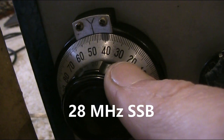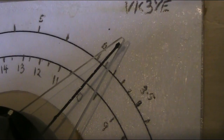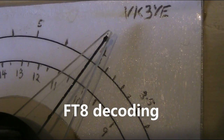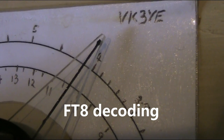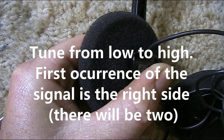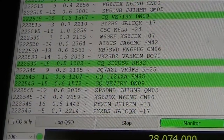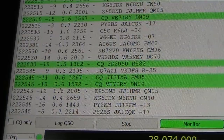As I'm using a 24 MHz crystal in the converter, 4 MHz coincides with 28 MHz. Just above 28 MHz, at 28074, is FT8 activity. With the WSJT-X software you'll be able to decode that even with a regenerative receiver like this. You can really tell the band is starting to open with more stations appearing on the screen — instead of just 2 or 3, it's now 4, 5, even 6.